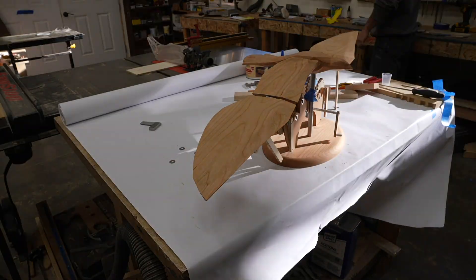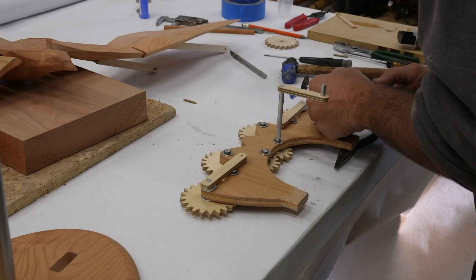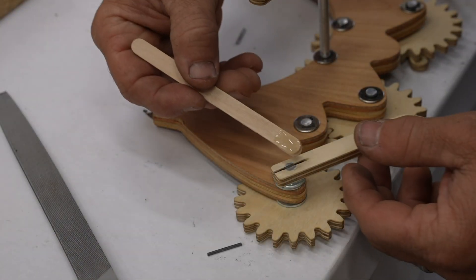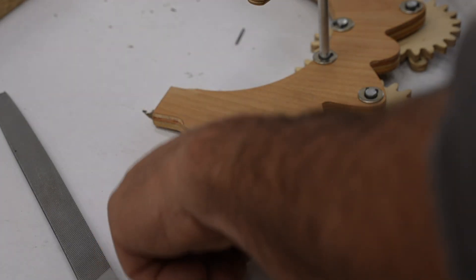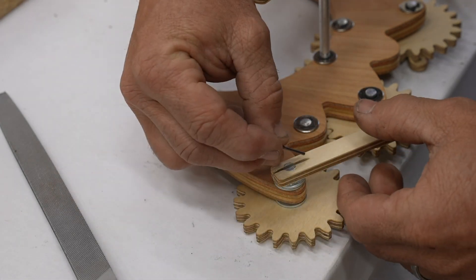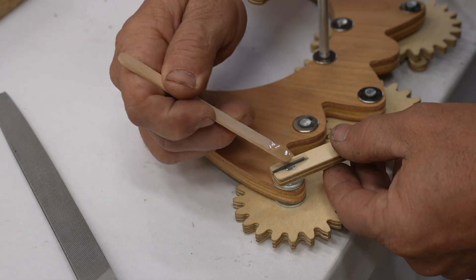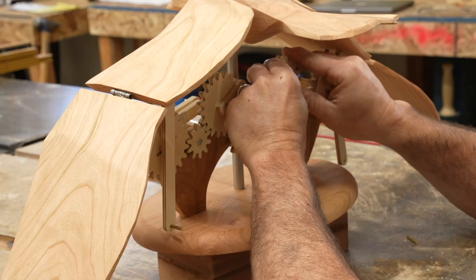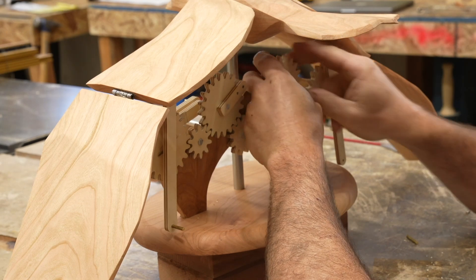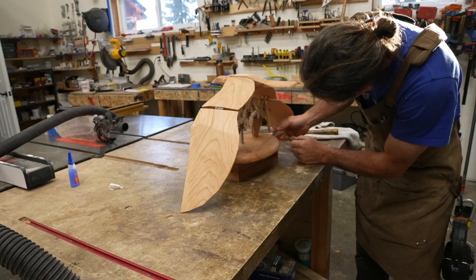Once I started to get everything together, I realized the shafts probably wouldn't be able to sustain the amount of force needed — even with a little bit of glue, they would probably slip and break. And this is what happened right away. This is the point where I wish I would have put more thought into the design. I didn't have enough spacing between a lot of the moving parts to have some other locking mechanism. So what I decided to do was use the Dremel to create a little slot in the aluminum shaft and the crank arm, and then put a little piece of metal — a piece of a bike spoke cut down short — into that area and use some 5-minute epoxy. So it's kind of like a keyed shaft, essentially, that's glued in. This was a total hack of a solution, and the one for the crank arm itself keeps breaking because the force on the crank arm with the small gear is pretty large to make it turn.